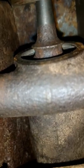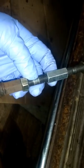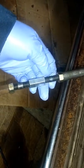Now I'm gonna take out this rod that I made. This is the original one — I found seven-sixteenths fine thread to coarse thread studs that I put on either side, then I used a regular coupler I got at the metal supplier. It's a very thick-walled sleeve, about three-eighths on the inside, so I bought a seven-sixteenths fine thread tap and tapped it. I'm gonna put a nut and lock washer on each side.